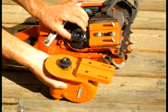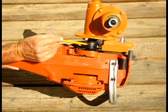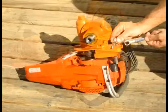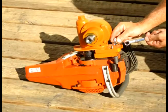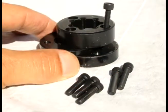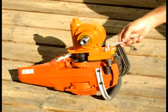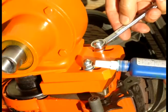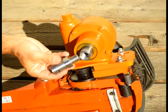Next, follow the instructions on how to put your adapter together. Put some thread locker on those, then mount the multidrill on top just to dry run and make sure that the adapter has a little bit of back-and-forth play, but not too much. If it has more than half an inch, you might want to put that spacer in there. Bolt everything on nice and tight, making sure the adapter is straight and has a little bit of back-and-forth play. These nuts also should have some thread locker on there to make sure they don't vibrate loose.